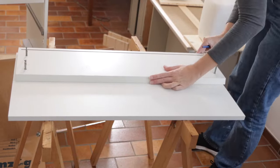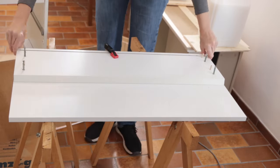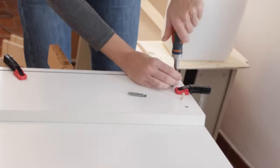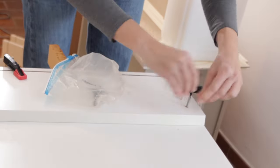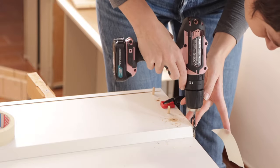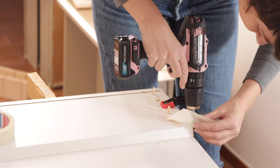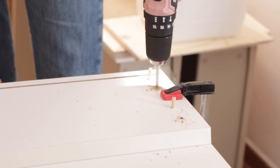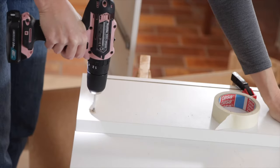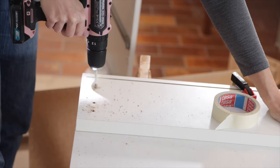I was a little bit worried about making sure that the holes would actually match the one on the original drawer. So what I decided to do was to just clamp the drawer to my new drawer front and drill all the way through the holes. When I removed all the pieces, I realized that the holes were two different sizes, so I actually used two different drill bits for this to make sure that the original hardware would fit. After drilling the first hole, I also realized that I didn't want to drill all the way through the front drawer. So I went ahead and used this really handy little trick of using tape just to put a marker so that I knew how far down I would have to drill. As usual with these projects, the first two or three holes were a little bit more challenging, and once I got that figured out, the next holes went super fast.